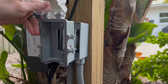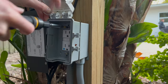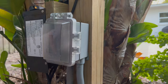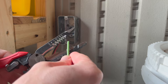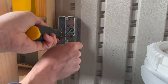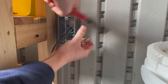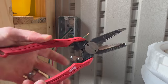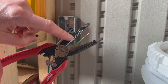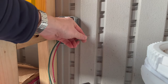Let's get the cover back on. I'll make a pigtail for our ground here. These wire strippers are great — I'll throw a link in the description. It's got settings for either solid or stranded wire. This ground is solid, so you just find the gauge — it's 12 gauge — clamp all the way down and just strip it right off. Super easy.